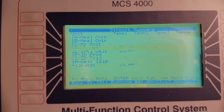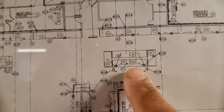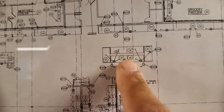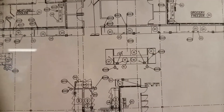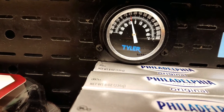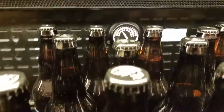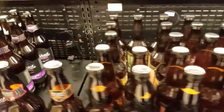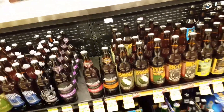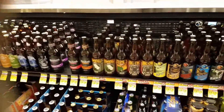So now I've got to figure out how many temp sensors are on the case. Because if you come here on your map, there's one, two, three, four, five, six cases - it looks like there are six cases all here but only one temp sensor. Okay, I found my case here. Temperature is 20 degrees, and up at the controller it's reading 23 degrees - that's way too cold for this type of case. This is a medium temp case and it's running low temp temperatures. Look at this - it's all beer, it's going to get frozen and pop soon. The problem's not at the case because this whole island is running like that. The problem's upstairs on the control - it could be an EPR, it could be a t-stat. Let's find out.